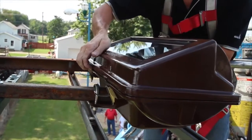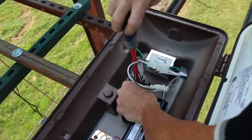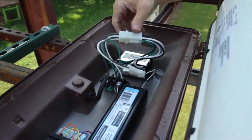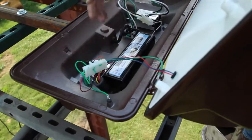Next, release the two door latches and open the luminaire. Connect the supply voltage leads to the terminal block per the installation manual. Ensure all wire connections are secured. Lastly, check the electrical connections to ensure any excess wiring is positioned inside of the luminaire to prevent wires from being damaged when closing.